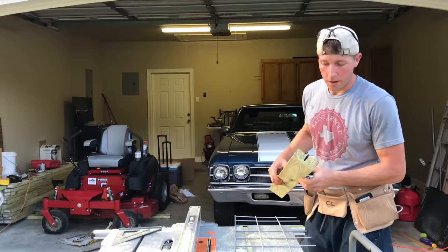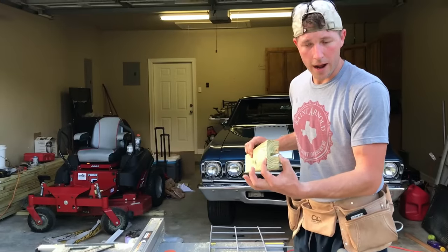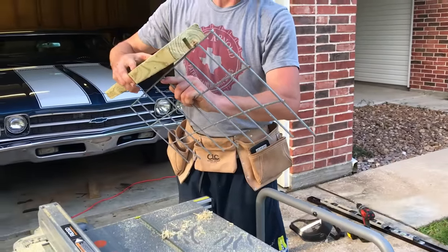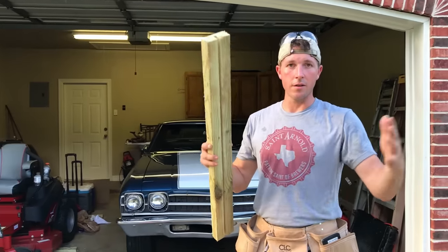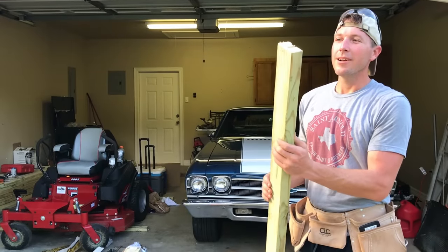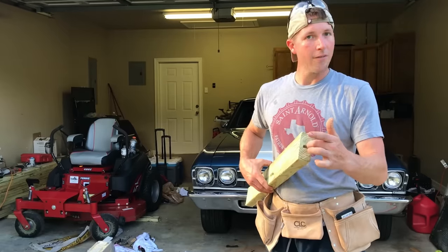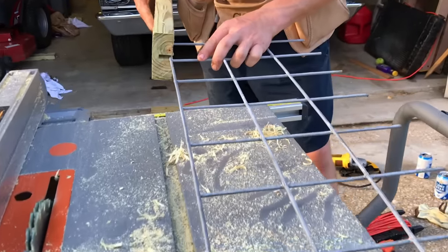All right, so I didn't go over exactly what I'm doing with the dado, but as far as the setup, typically a 2x4 is about 1.5 inch by 3.5 inch. I have the depth of my dado at 1 inch, which leaves me about 1/2 inch to play with. And my panels, I'm actually cutting about 1 inch short, 1/2 inch and 1/2 inch that I have to play with inside the dado. That way, if it's not exactly perfect, I don't give, you know, I almost said the S word. So either way, give yourself an allowance because you will have about 1 inch of play in there. And if you cut an inch shy, that puts you about 1/2 inch in there with your material. And it'll allow you to have a little bit of play in there whenever you're tying this together.